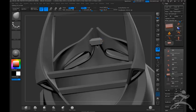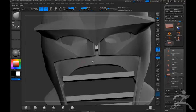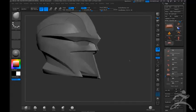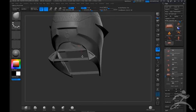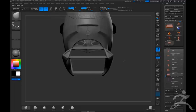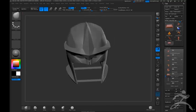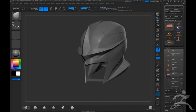No need to be concerned if these end up getting a little bit warped or deformed, because as I said, they're going to be ground right out. There we go. Now we have adequate support in there to make sure that this piece, which has to be left for a period of time after it's printed, doesn't end up having deformation on your model either during the molding and casting process or in the period of time between when it comes off the print bed and when it's handled by the next person in line that's going to finish it after you've finished your part of the process.